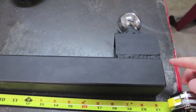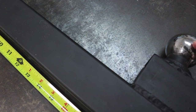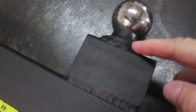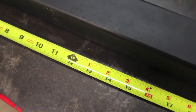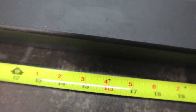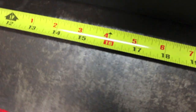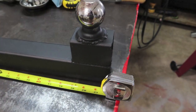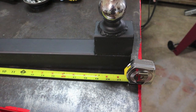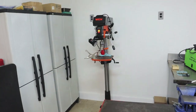What I didn't like about the original plan was it stayed low. I went ahead and cut this ball off — I had a couple of old balls laying around, this is a two inch ball — cut it off flat with the bandsaw and welded it solid on here. I cut three inches off the 24 inches, so we're looking at 21 inches from the bolt pattern, and put this on top for an additional two inches of height. I wanted to keep the trailer as level as possible. I measured off the tractor and drilled the bolt pattern.